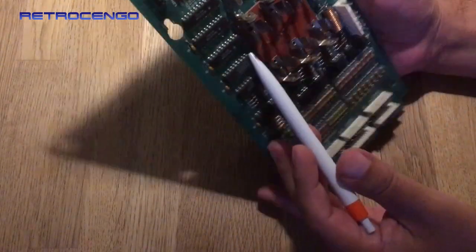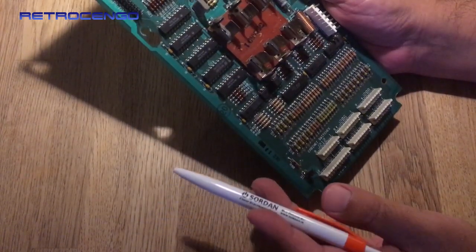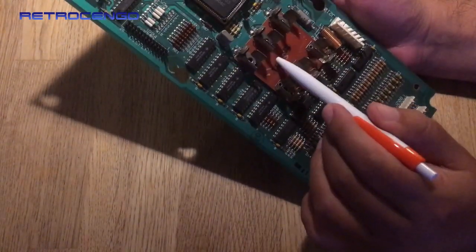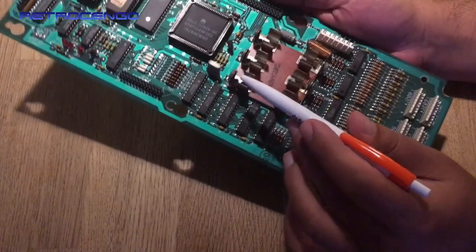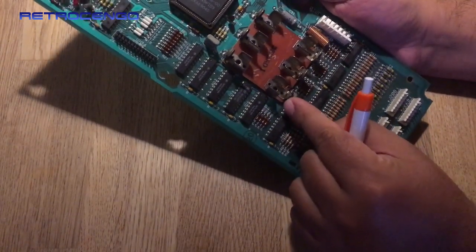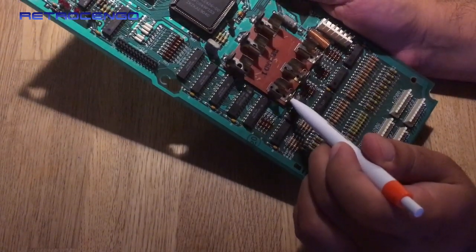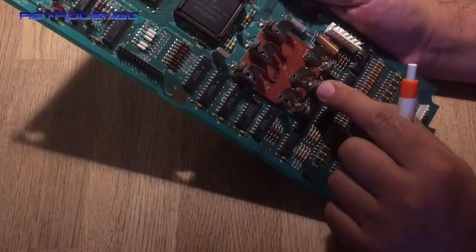The thing is, the batteries for the last many years, some of them have been leaky. At top here, these connectors, I really hate them. So in this video, we're going to replace it. At top here, it has got connection pads. Down at the bottom, the first one here, it's all gone. So the ground does not have connection to the next line. So this is just junk.